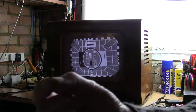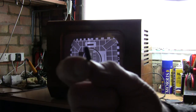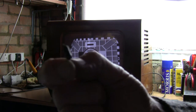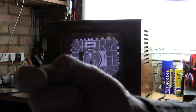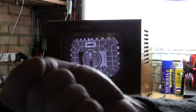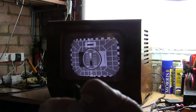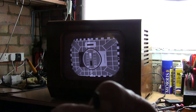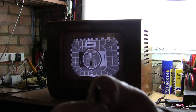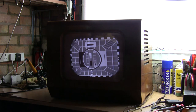That's the set. On the RF side it was absolutely packed full of these little colour-coded capacitors. I had several that went bang on me when I applied voltage. Because I tried to change them one at a time, looking at the more critical ones first from the data, but in the end I had to change virtually the whole lot on the RF side of the set, and it was quite a job.